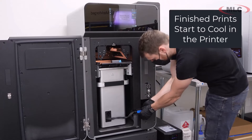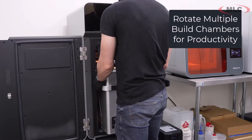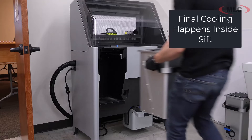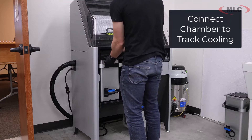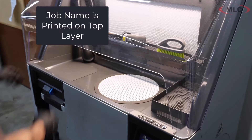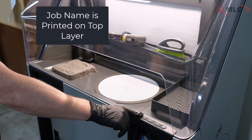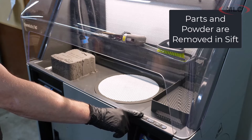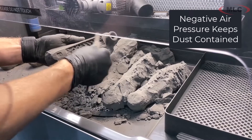When it's done, it'll do the cool down and tell you when it's cooled enough to transfer over to the sift. The key here is that even though it's not fully cooled and ready to be taken out, you can open up the printer and start the next job. This is very much focused on keeping high production — it's not great for one part at a time, but it's awesome for 20 or 30 parts at a time, or in this case, nine of these big cranks all at once. We'll transfer that partially cooled build chamber over to the sift. It actually prints the job name on the top layer, so if you have multiple build chambers done and don't remember which one's which, it lists it on the top so you can manage production quantities.